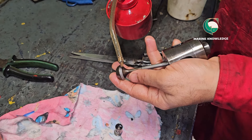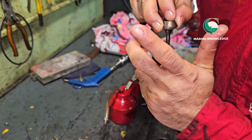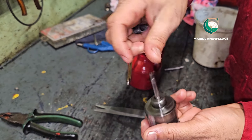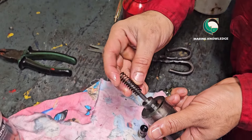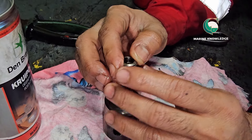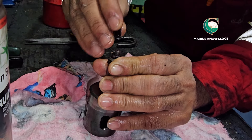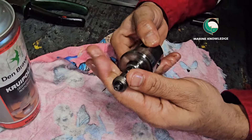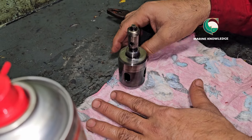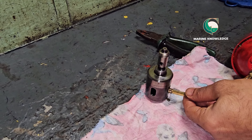Boxing up is also very simple for this kind of suction valve. First, insert the spindle — give it a coat of lube oil so that it will help to pass the slot. The spindle is in place; do a movement check, then fix the spring, fit the cone, and to lock the cone you have to fit the conical piece. This conical piece has to fix with the slot. Now you can see the spring doesn't come out and you can check the movement.